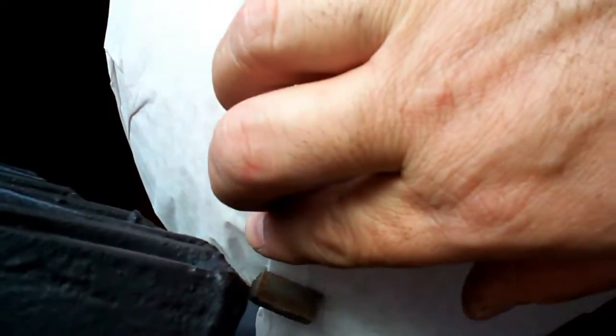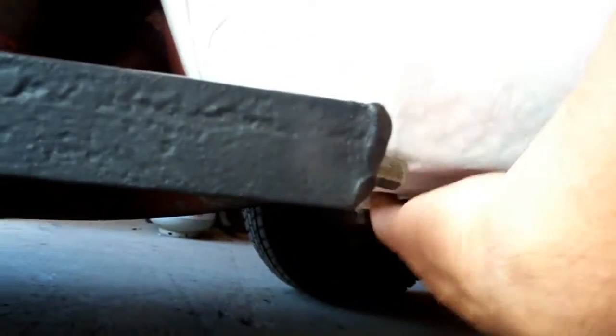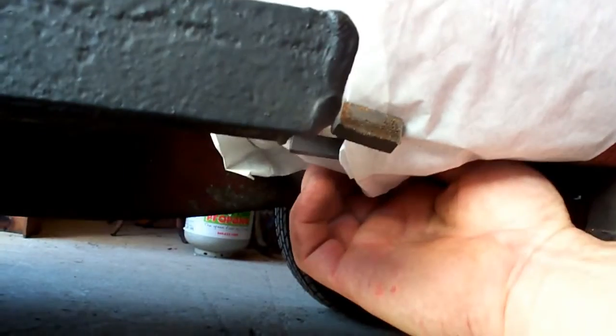Okay, now you've got to treat the paper like your metal. And basically we folded that over, we took a tuck. So we know that needs to be shrunk in there and shrunk in there, and it really comes under the bottom there. So that's where most of the shrinking is going to have to take place.